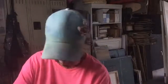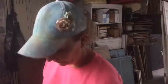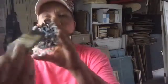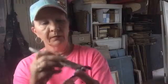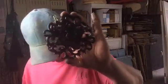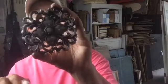I really don't want to get anything on this top because I've already got it ready almost, is I use Miss Lillian's Antiquing Glaze in the ebony, and I'll take just the white after I've pulled it out of the mold, and I just apply it with my chip brush, and I get it down in there in all the crevices, just like that right there. And this really almost gives it a very stone look. Okay, you can see that that is really in there very well. And then I'll just take a rag and I wipe that off. And you can see the effect that that gives.